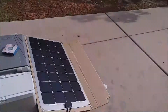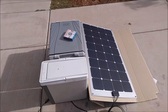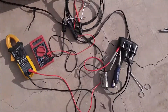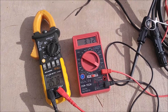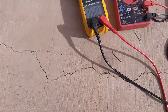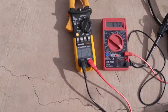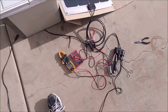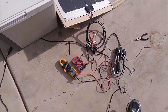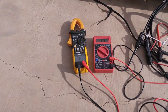I'm trying to get the sun to cooperate with me today, but I've got a 12-volt cooler hooked up straight to the solar panel via cigarette lighter. We are getting 3.72 amps and 11.04 volts. When the sun was not being covered up by clouds, we were getting over 12 volts and over 4 amps. And just to show you, we are getting about 30 watts right now.